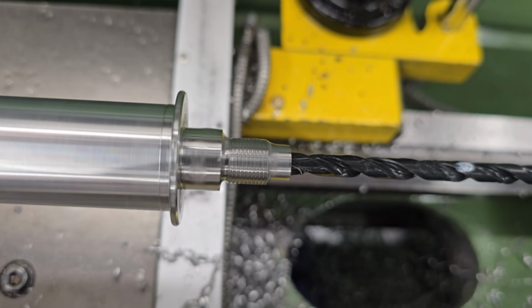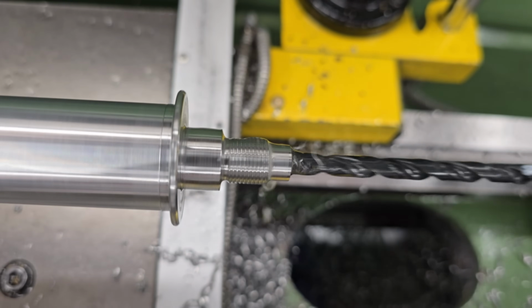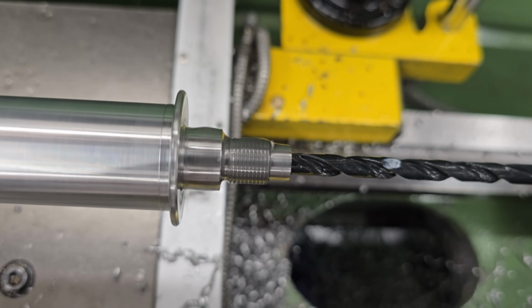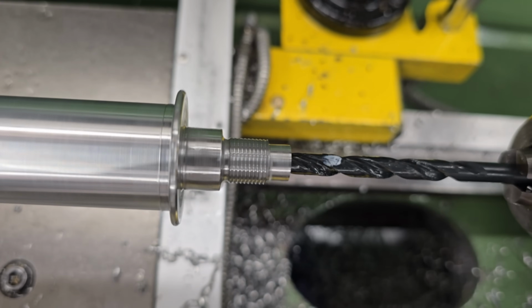If you wanted to keep the hole as small as humanly possible, what you would need to do is drill it out to 5mm, test the rifle down range. If it works, brilliant. If not, drill it out to 5.2mm and retest. With that done though, that's pretty much all the drilling done.